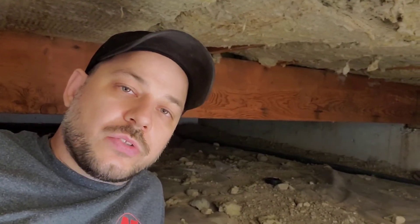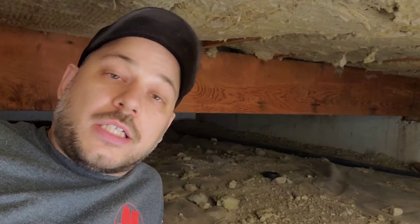That concludes the tour of the drainage system. What I'm going to do is start from the four-inch, put in a new four-inch cleanout, then rerun the laundry, the sink, the toilet, and I'm also going to put in a pan drain for the water heater. If you've watched my other video on water heater maintenance, there's no floor drain or pan drain there. I did put a mechanical drain in for the T&P valve and that saved me a big mess, but having a drain for your water heater pan is really a good thing — if your tank starts leaking and you're not around, at least the water will have somewhere to go.